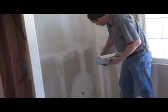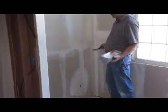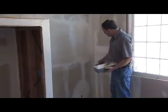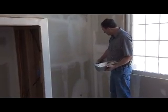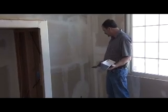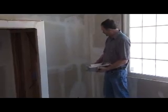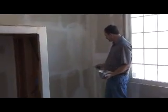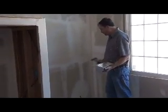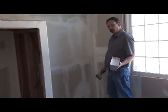The reason I said it's critical is because you can tear up the opposite side. If you don't do this fairly fast — once you put that mud out there, the mud is wet but this existing mud is dry. This wet mud will cause the dry mud to get wet if you leave it on there too long. You've got about a minute or a minute and a half. If you're learning angles, typically a person keeps playing with it and this side gets wet too, and then there's no way to make it look right. But that's normal for beginners — you've got to get it in just a couple of swoops.